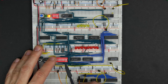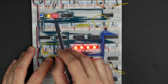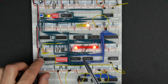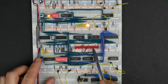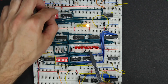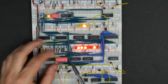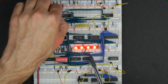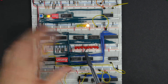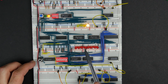Let's try setting a different pattern in here and write that. It looks like we write that. If we switch to address one, we get some other random garbage. If we go to all zeros here and write there, we get all zeros. If we go back to address zero, we see that pattern that's in address zero. If we go to address two, we get random stuff, but we could put in some other pattern like that. So it looks like we are able to put whatever data we want into memory by selecting the address here, selecting the data we want here, and pushing this button to write that data to that address.